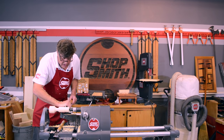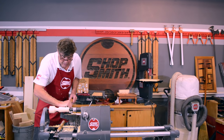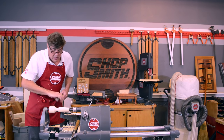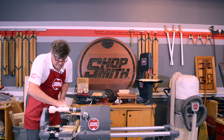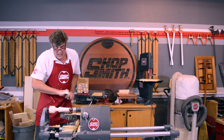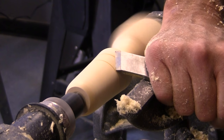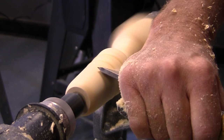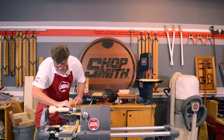The next cut we're going to make is a bead or a hill. First, put a little taper on our project — that's why you're not supposed to talk when you're turning. And with the skew, we're going to come back and just clean that up. Just like power whittling. To make the hill, you lay the chisel flat and you roll the handle over. Mark off where and how wide you want your hill to be and roll the chisel into that mark.